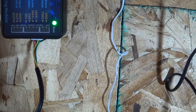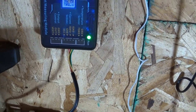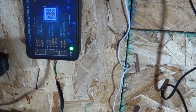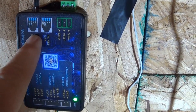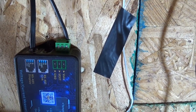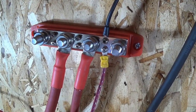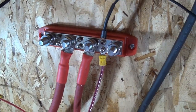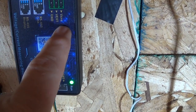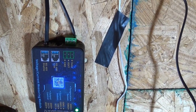I only got one screw on there because this is pretty much holding it. It hooks up into this middle connection — if you had a relay you could do the others, but I don't know what the relay does so I probably will never do one. This cable goes to the display. They give you this wire separately and you provide a power wire — it's 14 gauge and it handles 13 to 16 gauge. I just put it over to my power supply positive. That's how it powers it, and only one wire is needed, so the other two are left blank.